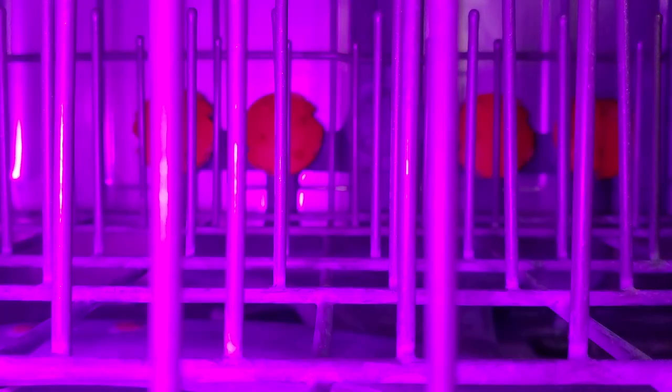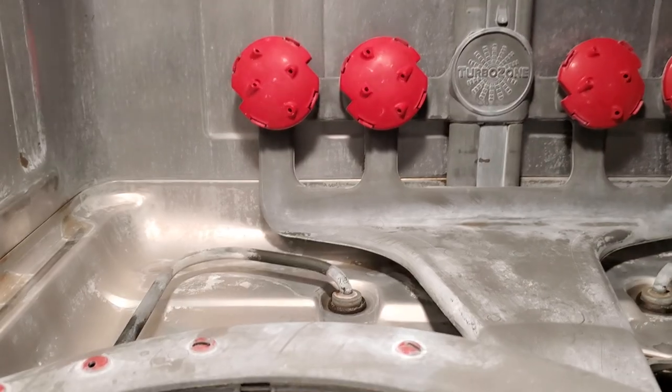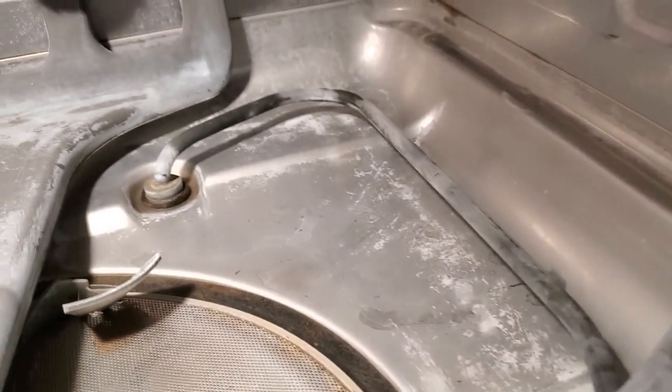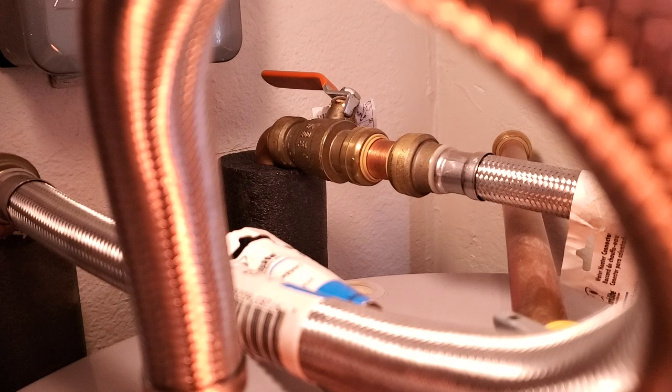So how is the water for washing dishes getting to operating temperature? In this case, you are relying on the heating element inside the dishwasher to do all the heavy lifting to bring the water up to a decent cleaning temperature. To add insult to injury, the water heater will be running for no good reason other than to put hot water in a line that will just cool off.